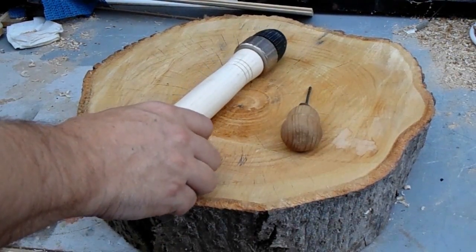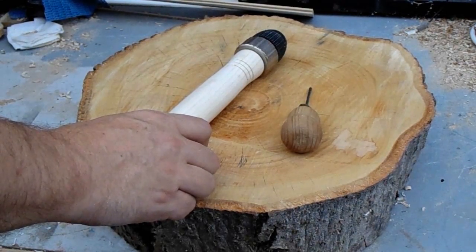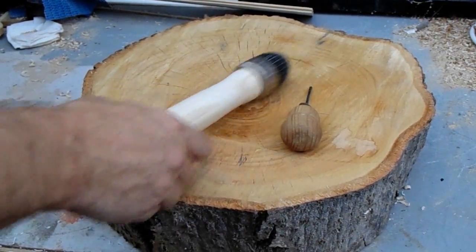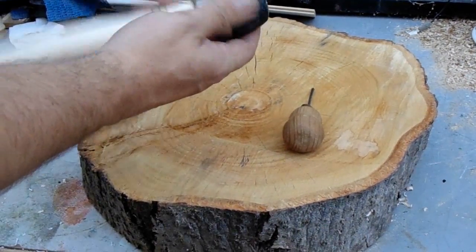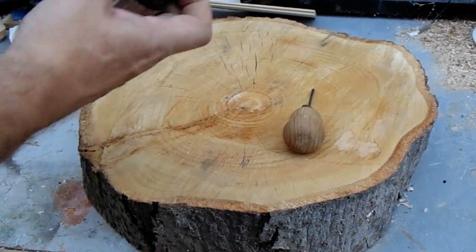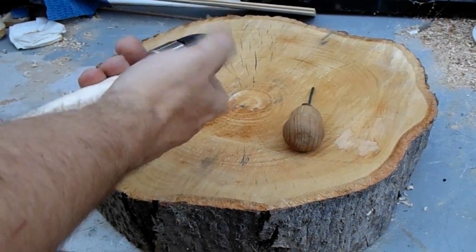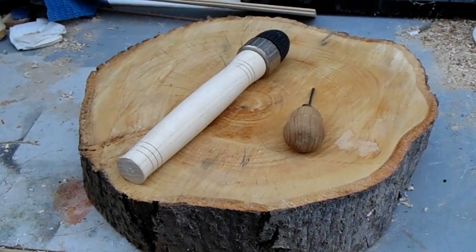And this is a sort of novelty. I was initially inspired by Robbie the Woodturner, who has a video — I'll link it below — showing how to make this particular tool. It's the chuck off an old cordless drill which had had enough and didn't work anymore. So I disconnected the old chuck and mounted it to a handle. It's useful for mounting drill bits so you can drill into the end of pieces on the lathe. Robbie does a really nice video on that, so I advise you to watch it.